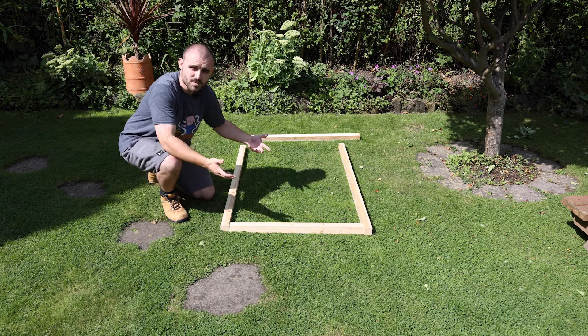I haven't got a measurement for the top piece yet because of the taper. Rather than use maths, I'm going to measure the size at the bottom from front to back — roughly 84 centimeters is close enough. I'll make sure the top pieces are also spread to that 84-centimeter mark, then offer up a piece of 4.5 by 4.5-centimeter wood to the corners to use as a guide for where to cut.